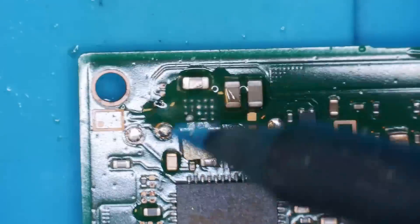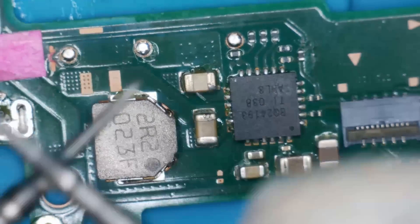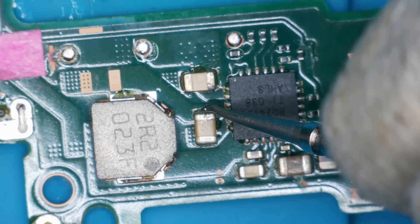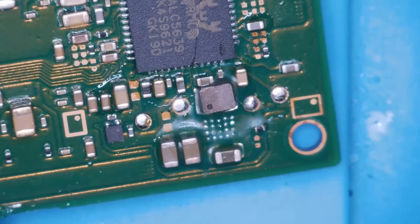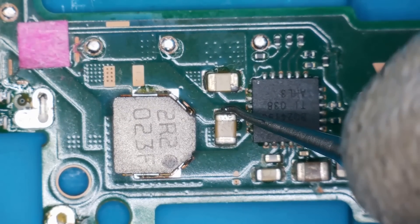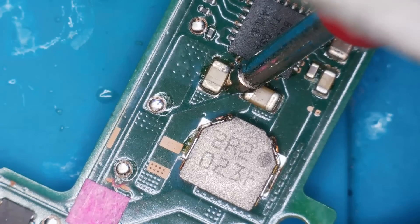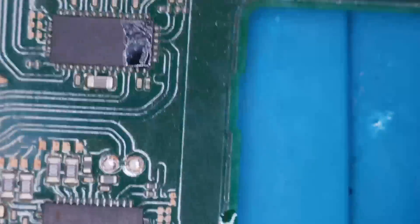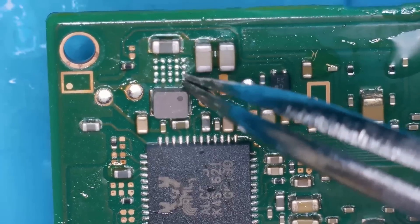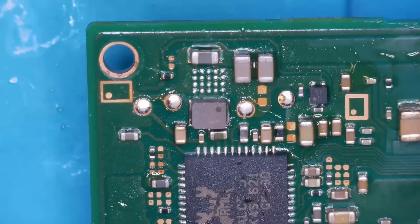I'm going to quickly take this component off the board and see if that gets rid of our short around BQ. Let's check — we've still got it, but it's coming up as 14 ohms now, not a dead short anymore. I may have bridged that cap with the inductor. Still a 14 ohm reading. Injecting again — now I'm getting 80 milliamps instead of a full amp. I think the shorted component was the cause, because the short has gone and I'm now getting 14 ohms instead of zero. I'll replace this component, clean up the corrosion, and give it another test.